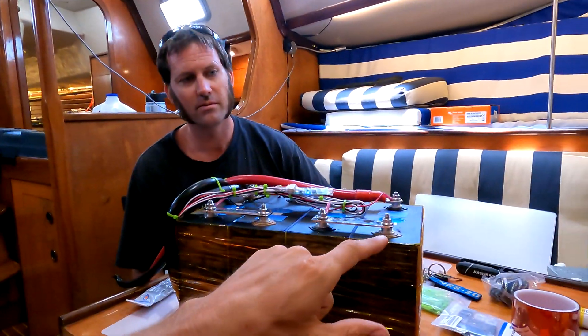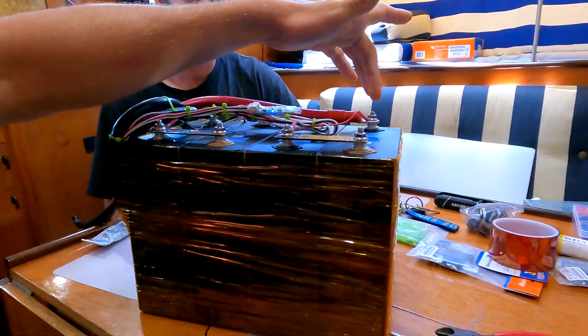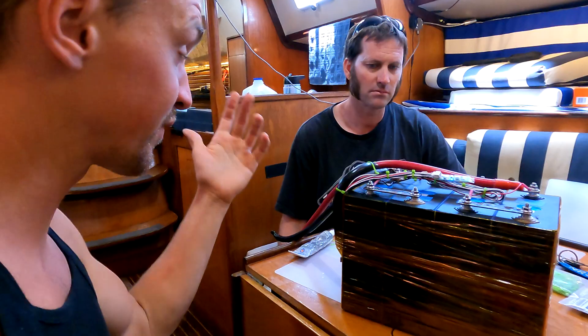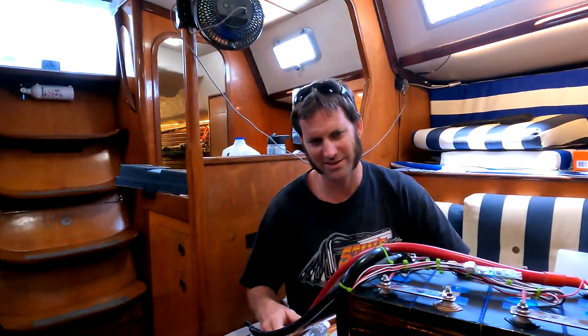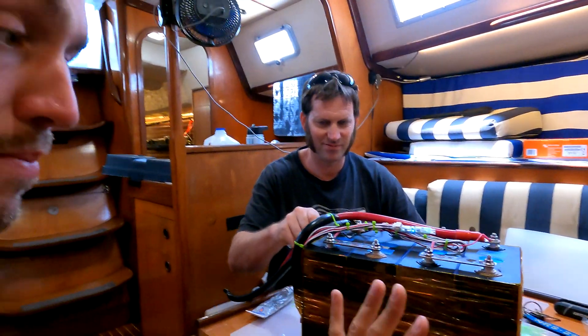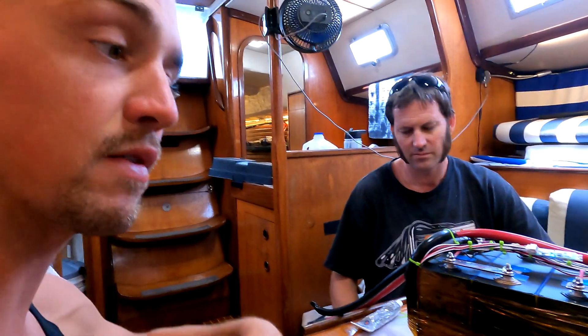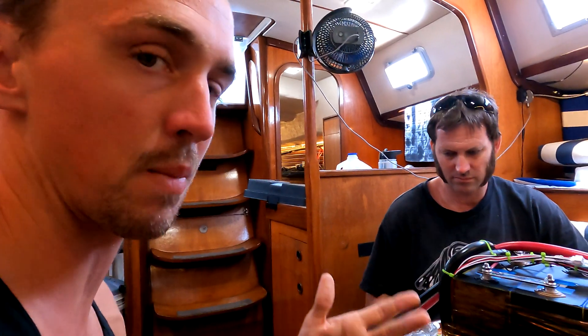We have these buses connecting to keep it going in series, and then we have our main positive and our main negative — that's what is actually forming the battery. Down here with these nice little covers so they can't go arky sparky. That effectively makes the battery. We're adding together the voltage from these cells to give us our 12 volts — actually getting more than that, but that's just how batteries work.